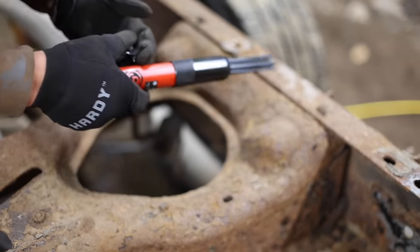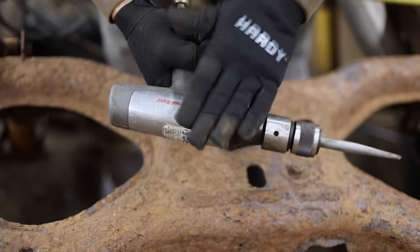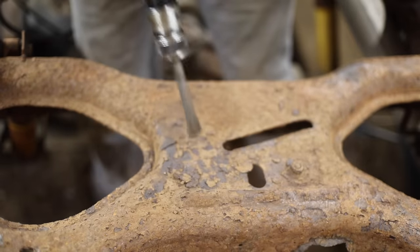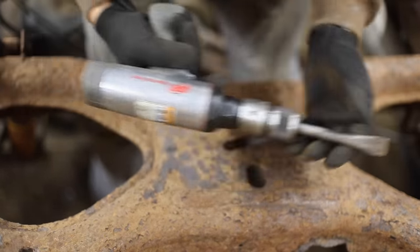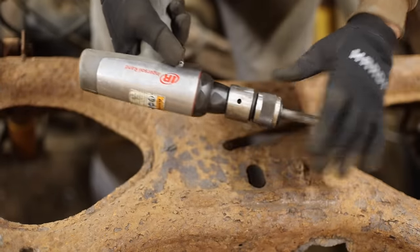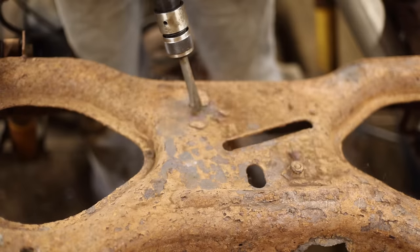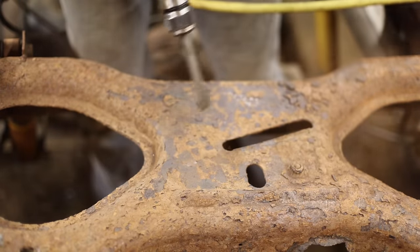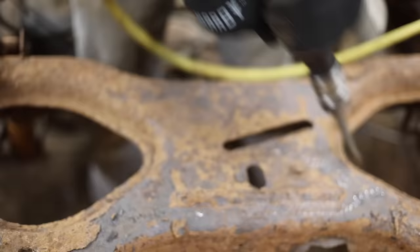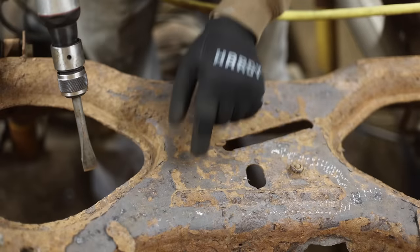All right, let's see how this thing works. I'm also going to try the air chisel on here to see how this does — this is pretty heavily scaled here. You know, this thing actually does a much better job on this. I'll put a link to this in the description below, and I'll also put a link to the needle scaler in the description as well. I think the needle scaler is good for a different type of job, but when it comes to raw power, the air chisel is the way to go. Look at that — that is fantastic. You can see there's bare steel under here, there's good solid steel.